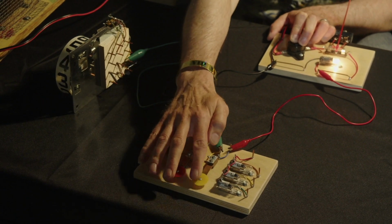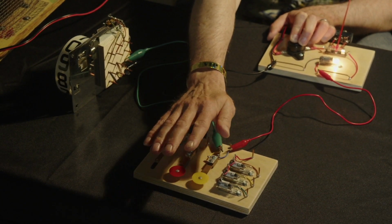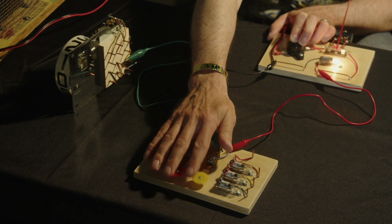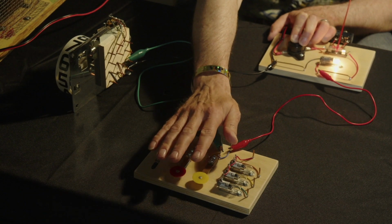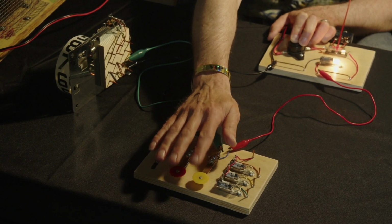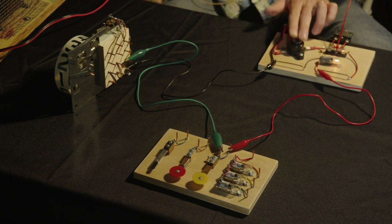Particularly if you've got a switch behind a rubber and the ball's just going to kind of graze it, you can get a small close of that switch, and it's not very reliable. Before we're done, we'll be adding reliability through the relay to that circuit.